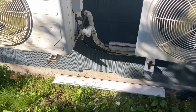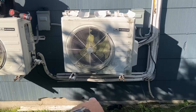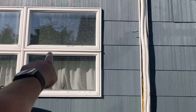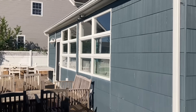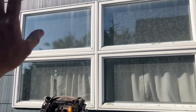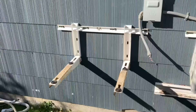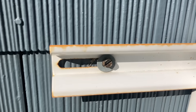We're going to be taking this unit out - disconnecting the electric, disconnecting the communication line. Right here in this rear extension room we have a lot of glass, so 18,000 BTUs is perfect, especially because of the weak and poor insulation of the structure and especially the glass. We have the unit removed off the wall mount bracket.